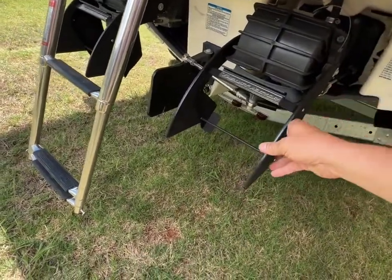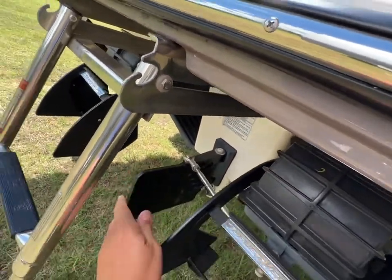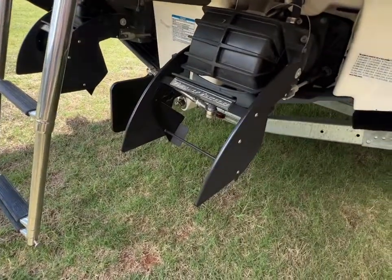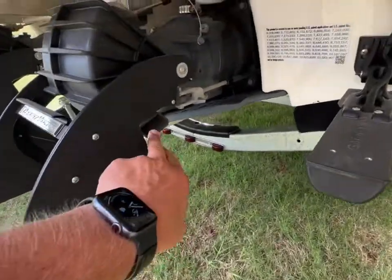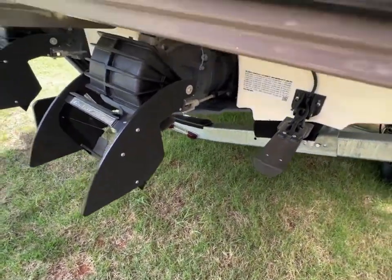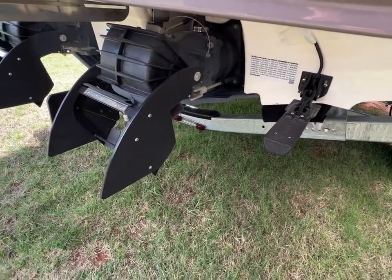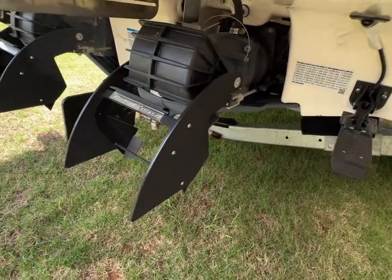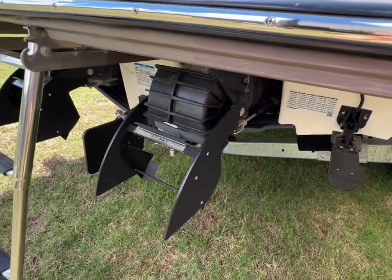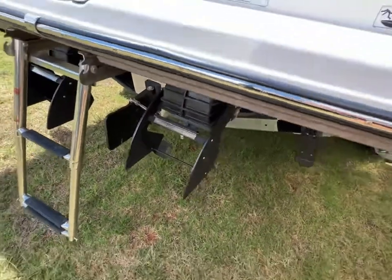However, with these on here, the engines turn right along with the steering wheel at the fin. So these rudders fall in the water and they will help you steer at low speeds — they actually do a great job. You can put this thing exactly where you want it. This also has the side thrusters, another thing I added, so that you can just activate one engine in reverse. This is a dual jet engine — I believe they're 115 horsepower apiece. It shoots water out this side and pushes you the opposite direction, so you can use those side thrusters to put it exactly where you want it. It's great for docking, getting in and out of a slip, and tying up to other boats.